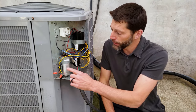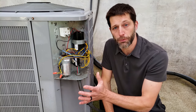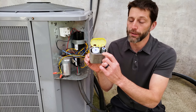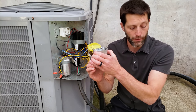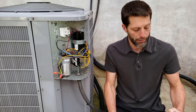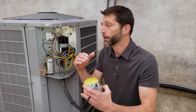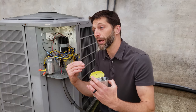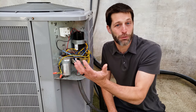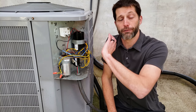This is different than a run capacitor. A run capacitor stays in the electrical circuit the entire time — any time that the PSC motor is running — and a run capacitor has a metal shell just like this with dielectric fluid in there, so it can dissipate heat well. A start capacitor cannot, so things like surrounding temperature or voltage irregularities from the power supply won't affect a start capacitor as much because it's only in the circuit for a quarter second of run time.